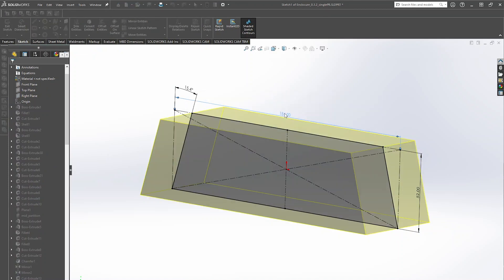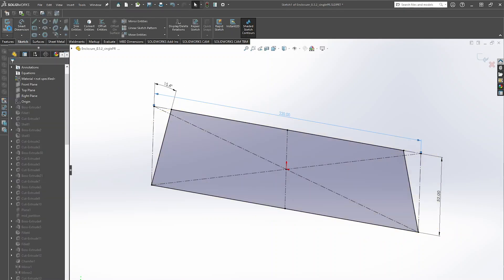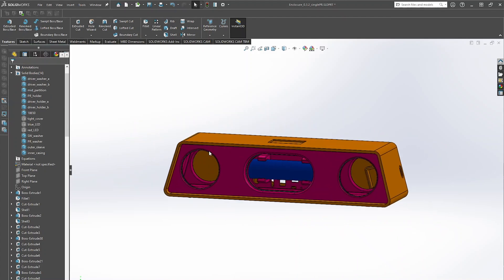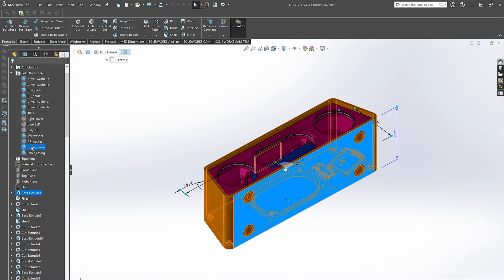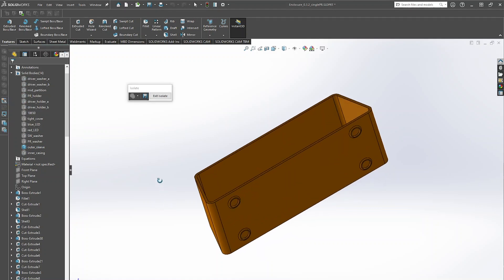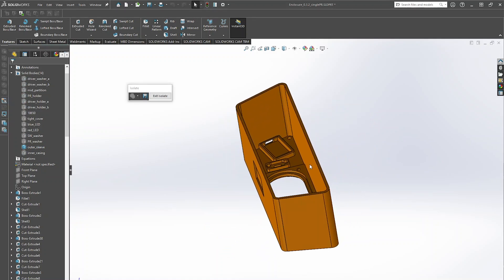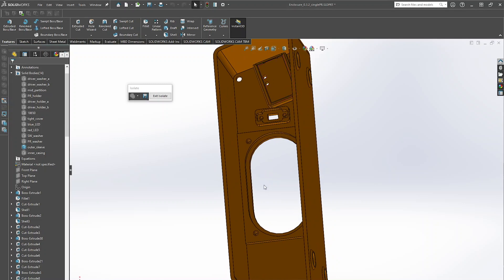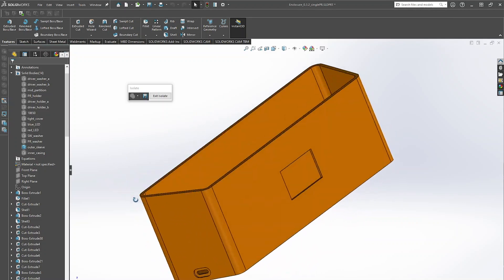Because you can't know from the start exactly how large the outer casing needs to be, by doing it all in a single design tree you can go back to your very first part and change the dimensions — say making it 220mm instead of 186mm if you need more volume — and everything automatically rebuilds. The outer sleeve is the part I print in different colors — red, black, or white — it sits flat on a build plate and holds things like the switch, the charging board, and the passive radiator, with no support material needed at all.